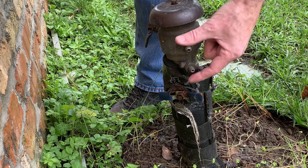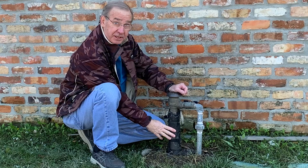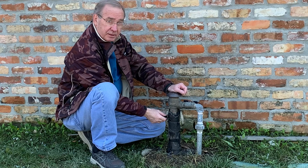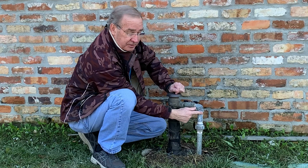That should be all I have to do because now the water in here, instead of freezing, is going to come out of here and just drain out. This is your supply side, so it's good practice to insulate all the way up to the middle of this block valve. It wouldn't hurt to go a little bit higher. This side you can decide to insulate it if you want.